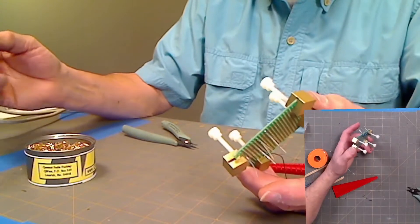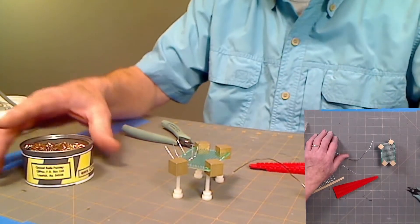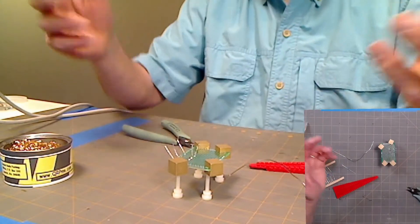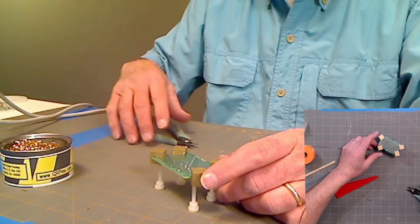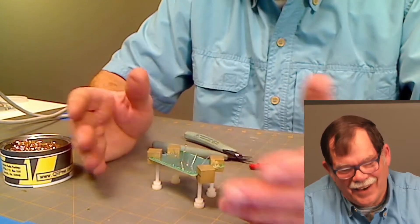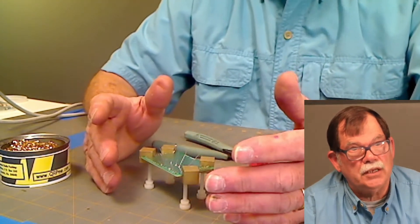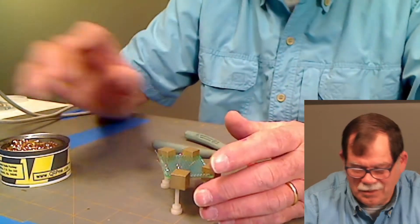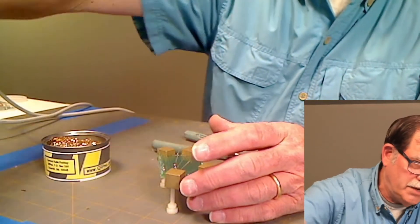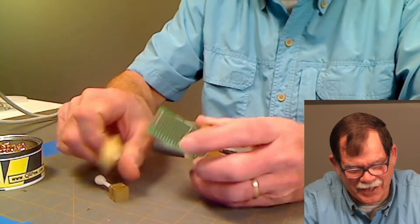You really want to create a draft so any smoke is directed away. Everybody says you're bending over this and getting lead fumes, but there's no such thing as lead fumes when you're soldering because the lead doesn't vaporize at these temperatures. What you're smelling is the flux fumes. You shouldn't be inhaling anything you don't have to, so a lot of people put a little fan sucking air away to keep the smoke going in another direction.